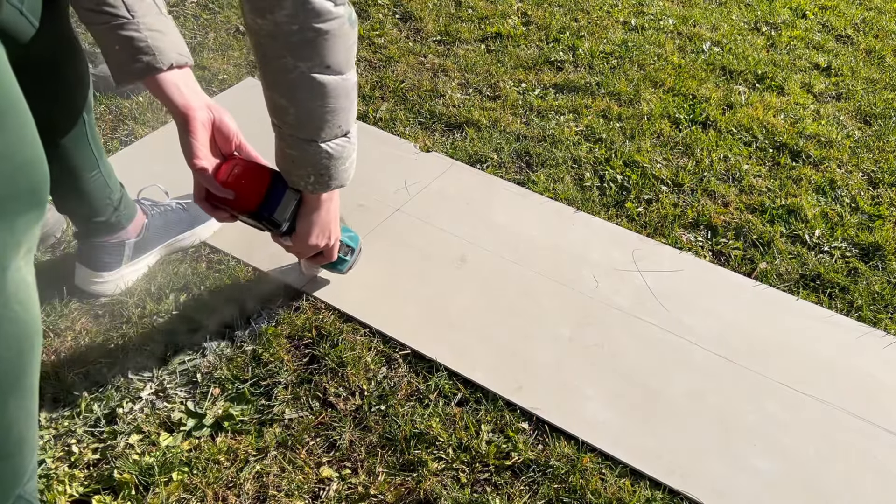We're back working in the bathroom today and going to be applying the floor tiles. I wanted to show you applying the primer — this primer is supposed to go on before you apply the waterproofer on the walls and floors, and then also after you've applied the waterproofer between the waterproofing and the tile glue. The waterproofer is already laid down on the floor and now we're going to put the primer on. Once the primer has set — it only takes about 15 to 30 minutes — we can then lay the tiles. It's a really clear substance and it dries clear so you can't even see it. You can apply the primer with a paintbrush or a roller, but since this was just the floor I chose to go along with the paintbrush.